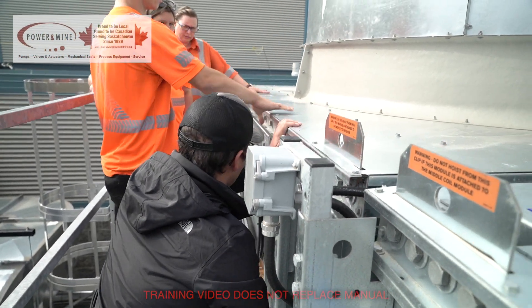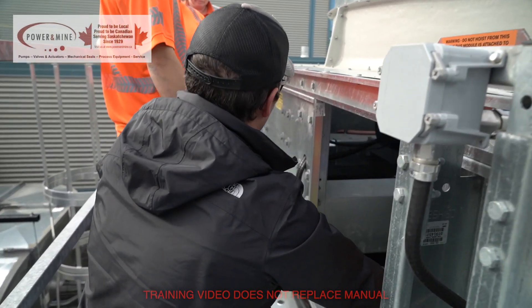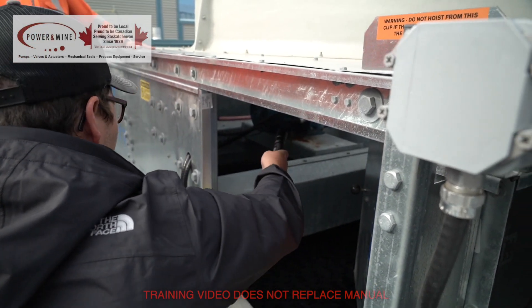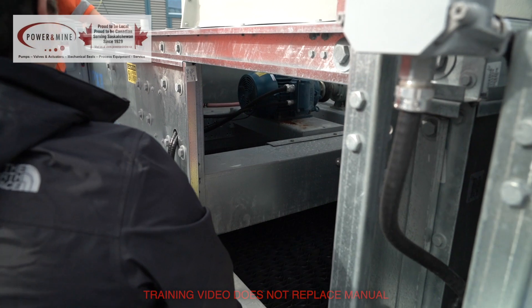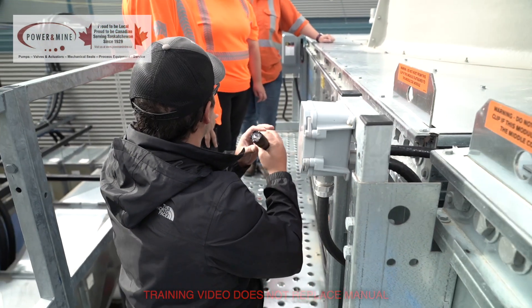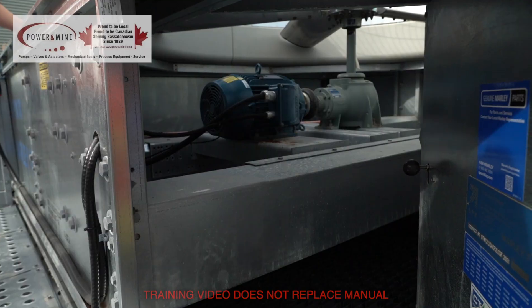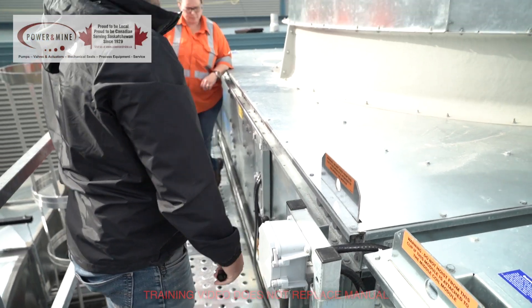This here is structural, but you cannot step on the black fill because that's not structural. There are structural beams in there too. If for whatever reason you need to access the inside, it's important to watch for icing on the fan. If icing builds up on the fan as it rotates around, eventually it's gonna let go and could potentially damage some of the internal components.